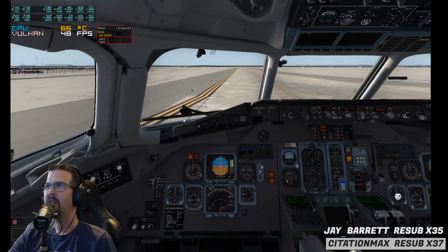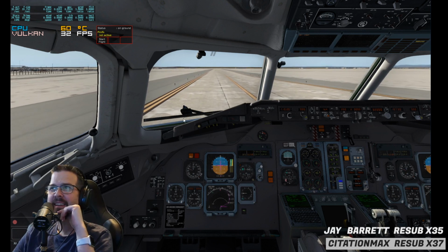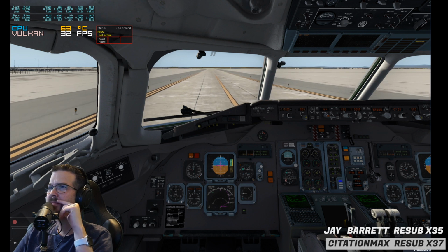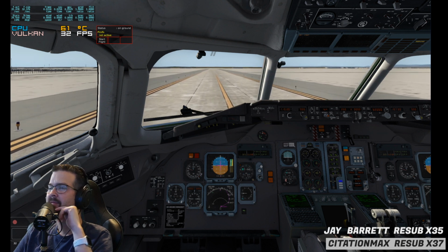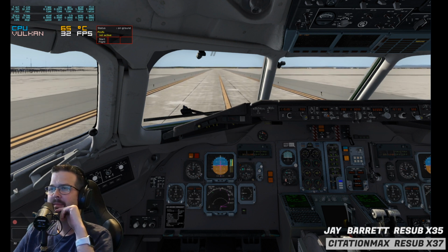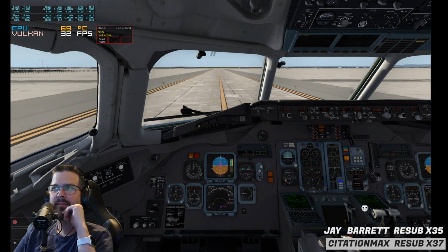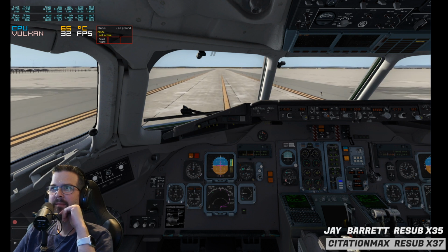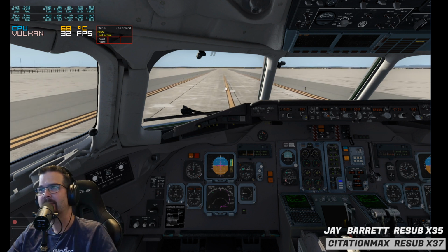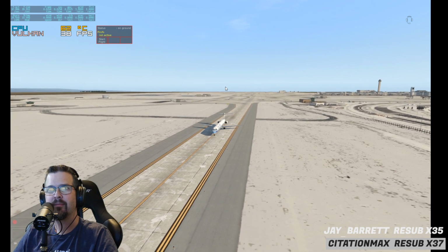Okay, so story. That Venturi switch. What that does is if the fan to cool down the electronics fails, you put it in the Venturi position, and it opens a valve behind the cockpit, behind the main door, below and by the door. It takes all of the air from the cockpit and the E&E compartment, electrical compartment, accessories, stuff. It takes all that hot air and blows it out through that Venturi. You never use that switch unless you have the fans fail.